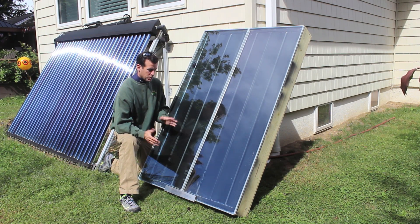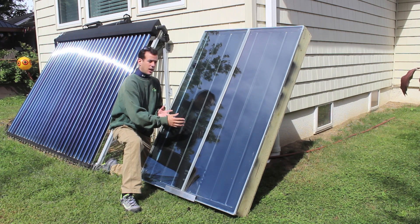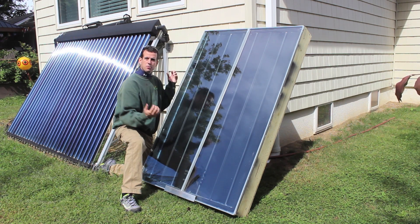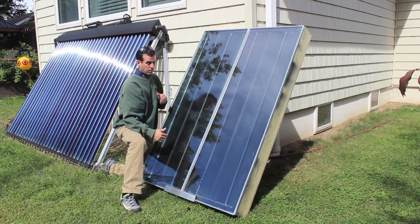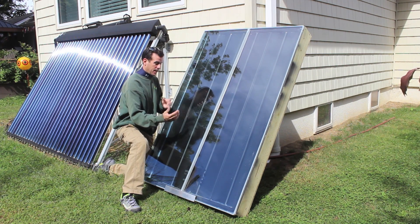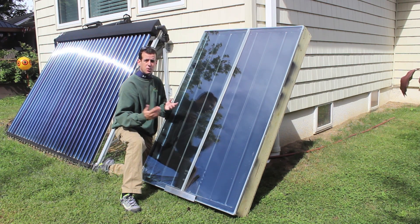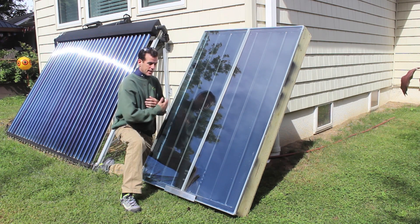For any collector, I would suggest there are basically three components: absorption, retainment, and distribution. You want a device that absorbs as much of the sun's heat as possible — which is why we have it painted black — and you want the most square footage you can collecting that heat. The next part is retaining that heat, because once it gets really hot — say 150 to 200 degrees — that heat will want to transfer to a colder area. So insulating is key, and having the glazing be insulated is also important.